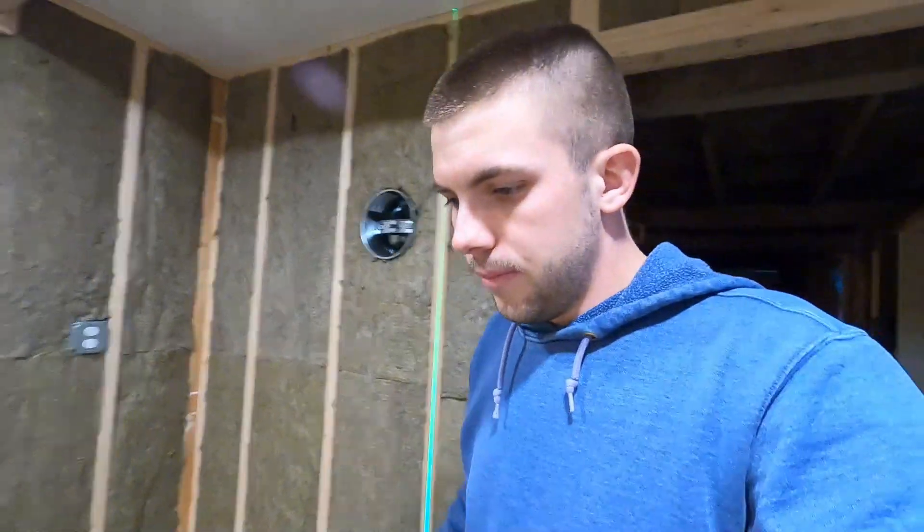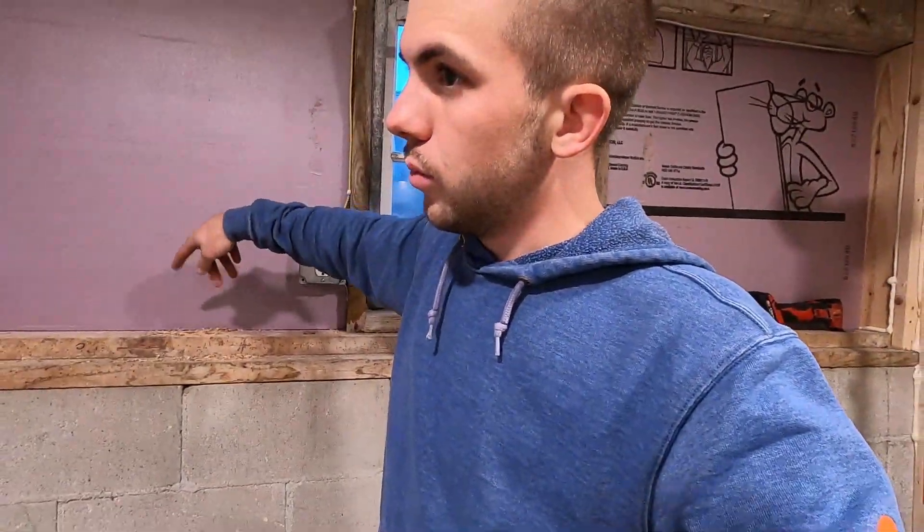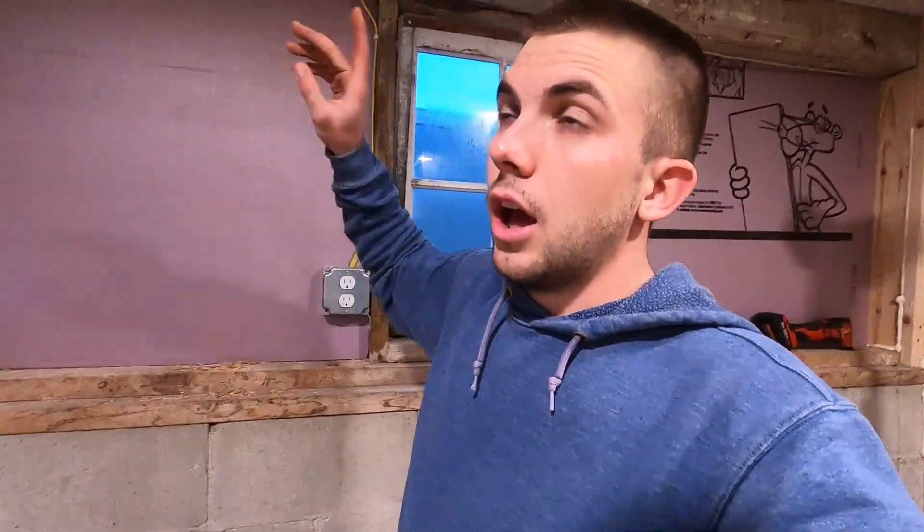A new brush guard was not that expensive, but it is showing delivery in October. So last time you guys saw me working in here was when I was putting the exterior sheeting on. Since then dad did the electrical, I put rock wool insulation on the walls, I put foam insulation on all the exterior walls — cut them out, fit them in, and glued them in. I put foam insulation on the ceiling as well, and we've also got a ceiling and lights. It's getting along. Right now I have it set up — we're going to put the first piece of interior lining up, so you guys get to see me do that. Let's hope I measured it right.